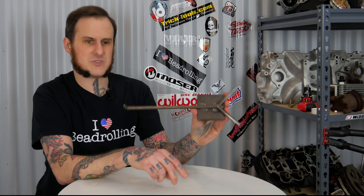We often wish we had three hands — with this a welder can. It's just a really simple little thing that really makes a big difference when it comes to welding, for setting up those brackets, for setting up whatever you need. Every little piece of jigging and helpful holding apparatus you can have when you're welding is gonna make your life easier. Personally when I'm at the welding bench I use these things a lot. I have a couple of them I've made out of some old pieces of rod stock and some plate I'm using as weights.